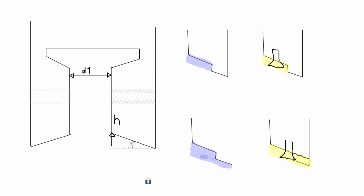So if we check the surfaces here, first of all, we have this surface, which is the reference for the angle. So with that we know this is 15 degrees, so this angle is 105, and we get the angle right, and don't mess that up. The outside is no good, but this area is fine for the angle. And for the height, I found out that this and that area, they are good. Not the middle, don't use that one, that kind of drops differently, I don't know why, but you can use these two areas to align everything, because this area is no good. You can't use that one.